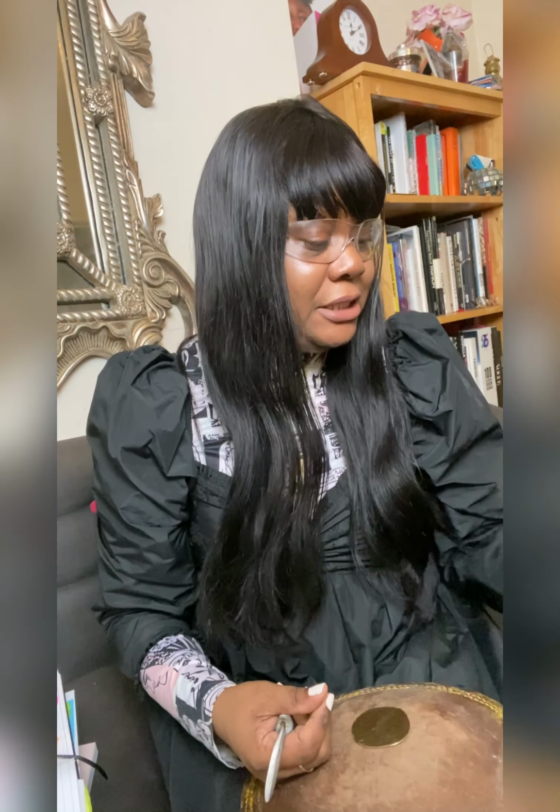That I've been using since I was at jewellery school, and it's very handy. I use it with this type of hammer. I think it's a chasing hammer. And to file, before I actually use the sandbag, I'm going to be filing around the metal just to give it a smoother finish. My other tools that I'll be using with the sandbag are the doming punches. They're going to help me to be hammering and forming the metal.